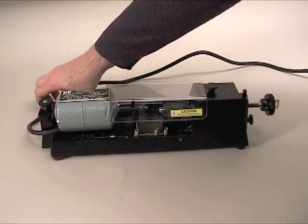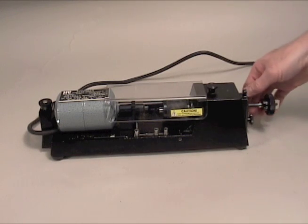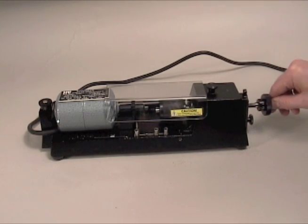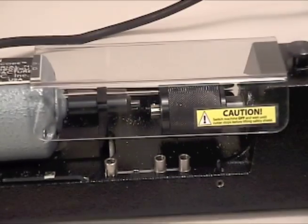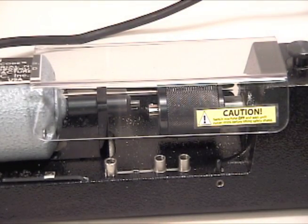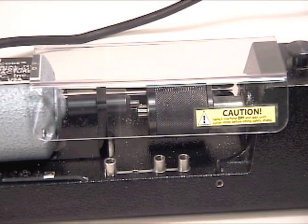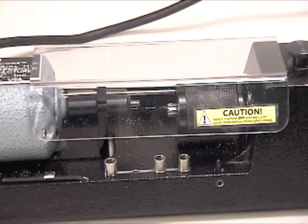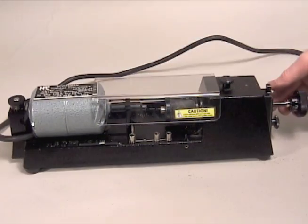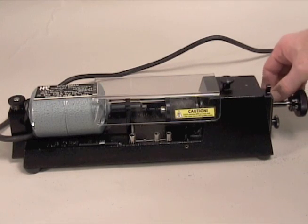Set the depth knob to the depth for the first space. Push in and turn the position knob to the first space. Continue slowly pushing until the shaft stops. The corresponding depth has been cut on the key blank. Slowly disengage the blank from the cutter.